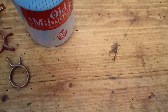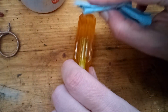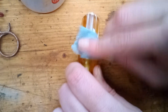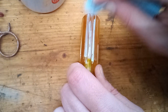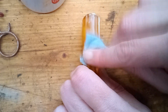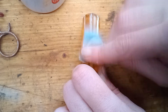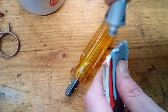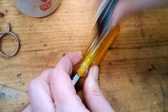To do the final polish on the handle, I'm using Flitz. Flitz works on most plastics. This final step is going to remove the haze from the plastic. I recommend doing this by hand — you can use an electric powered buffer, but you run the risk of overheating and melting the plastic. To get the polish into the grooves, I wrapped a paper towel around a piece of cardboard. That seemed to work pretty well.